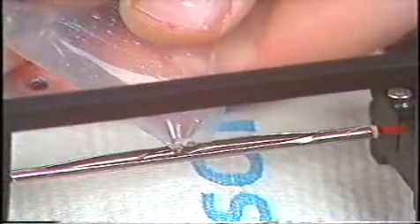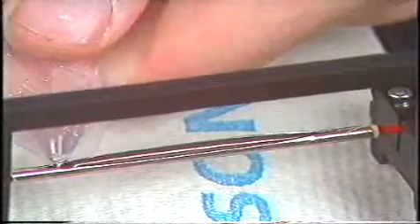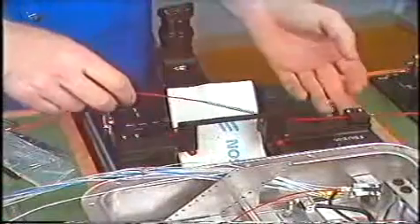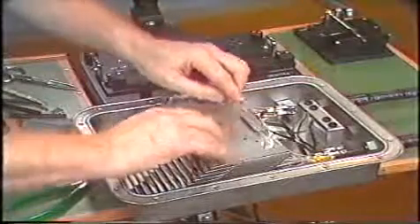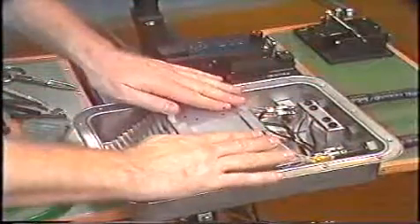Place the spliced fiber on the storage shelf. To prevent eventual condensation, a number of silica gel bags are placed inside the box. A pressure tight seal between the box and cover is obtained by a rubber gasket and a number of allen key screws.